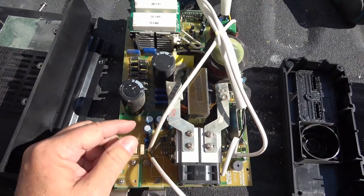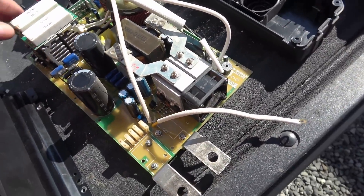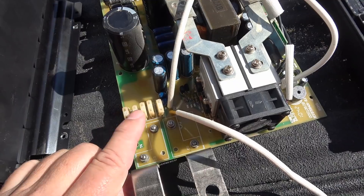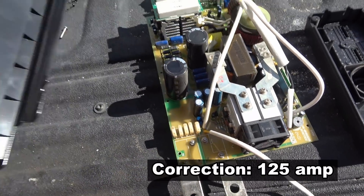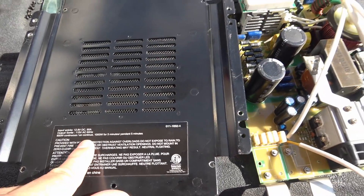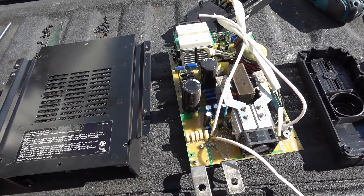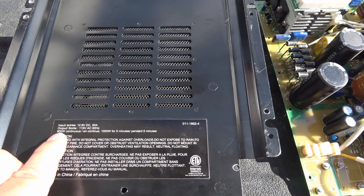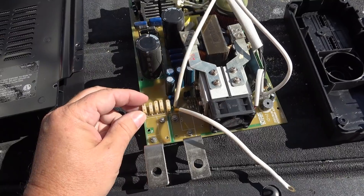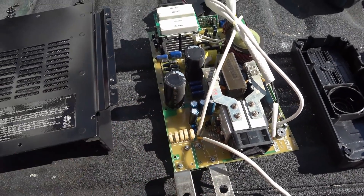It really only runs at around 100 watts constantly. Flipping it around, everything looks good on the other side — all the capacitors look good, no puff tops or signs of failure. Interestingly, there's a row of 25 amp fuses soldered to the board, all in parallel to make a 100 amp fuse. The max DC input is 90 amps, and looking at the specs it shows 900 watts continuous and 1000 watts for five minutes, but no mention of any surge capacity — and with that fusing arrangement it definitely can't surge.